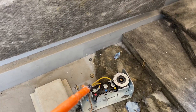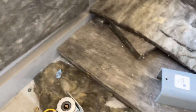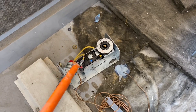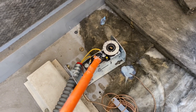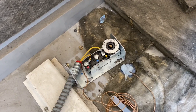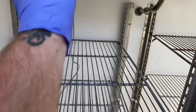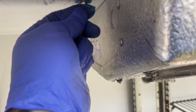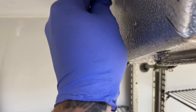I'll take our two leads off the thermostat - you can see they just had the flex shoved in there. We'll pull that flex out and then get the probe out of the box. We'll remove this thermostat, leaving us two wires: we've got 110 coming in and then our switch leg that goes through the high head pressure switch to our contactor. The probe was behind the coil in the return area - that's where we'll put the next probe also.